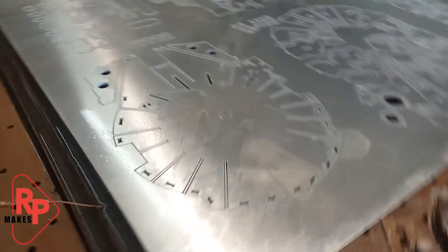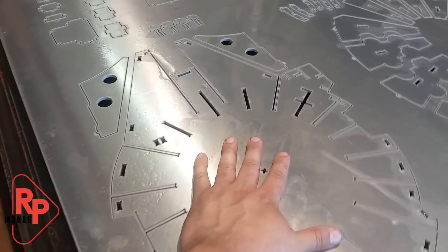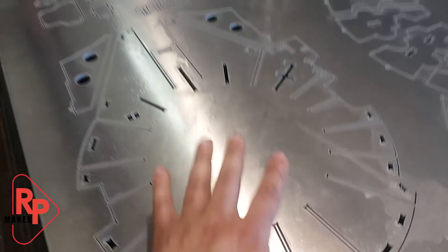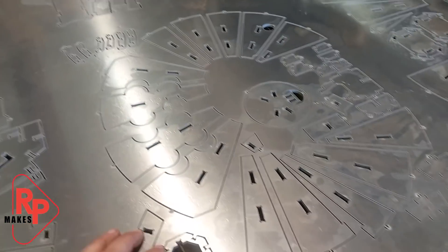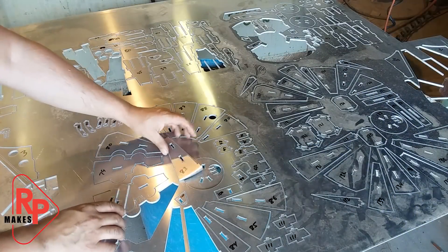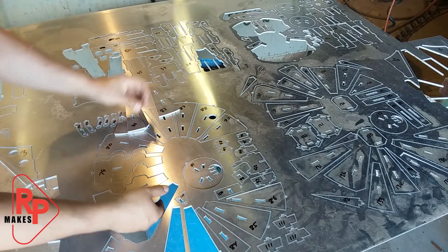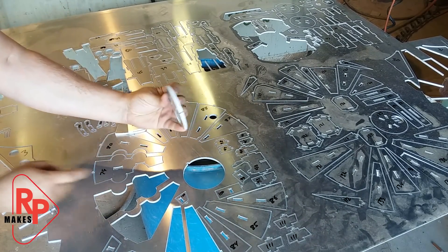There you have it. The finished parts are all cut. Look at the size of this Millennium Falcon — it's going to be pretty nice. I just got to take it out of this plate now. You can see these little tiny tabs. It's not necessary for a part this big, but when you have parts that are this small, they can fall into the table. So I went ahead and tabbed all the pieces so that we can remove them, sand the tabs down, and get it put together. Additionally, there are so many pieces, I needed to know which ones are which — I went ahead and numbered everything on the sheet.